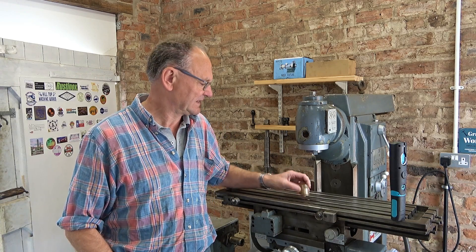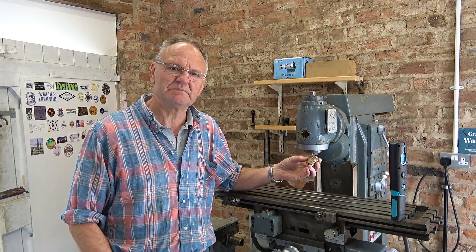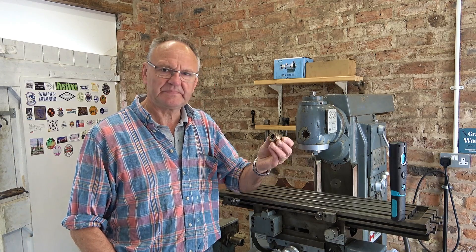Welcome to Hacksby Shed. This time you find me in the middle of a project because I'm making a new table nut for this Harrison milling machine, and when I look at this nut it's got a 48-tooth spline on it.